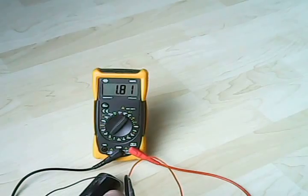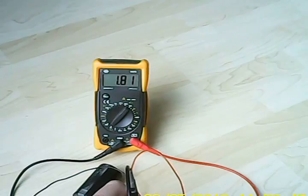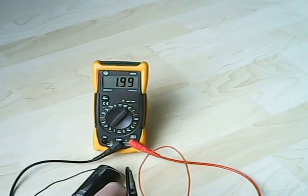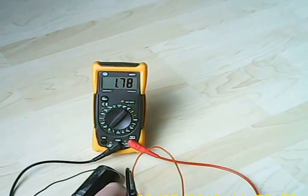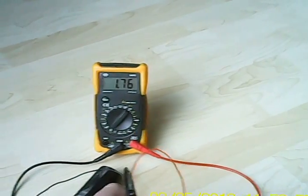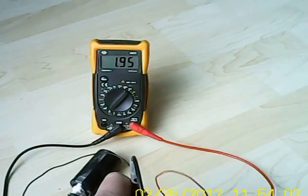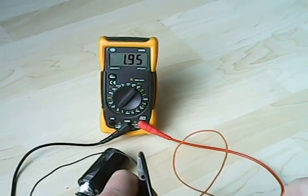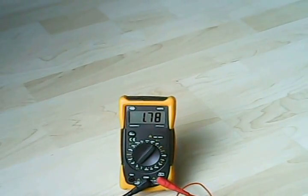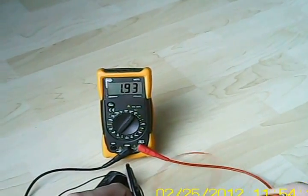I am working on my gut now. I really don't know how long I should tap it. I am just playing around because it is a long way to rejuvenation. It takes a couple of times, the same process. If I would just empty my caps into one of these batteries, it would get really hot. Because super caps have an enormous power, you wouldn't believe. Let's take off the super cap and test the battery again — 1.38, 1.37. That is good.